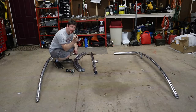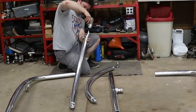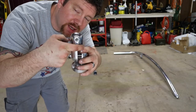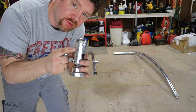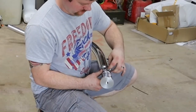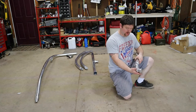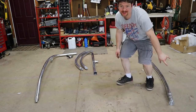Moving on to the short legs: you want to put one of the non-threaded joints on each short leg, and then one threaded one on each side. The next step — they call this the S-knuckle mount. You take the piece that will eventually mount to your hull and attach it to this S-knuckle, then attach the S-knuckle to the front legs. This gives you more movement when mounting to the hull, on the side of the bow or even on top depending on your situation. Repeat that step on the other leg.